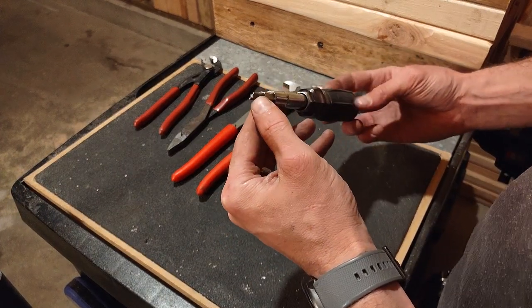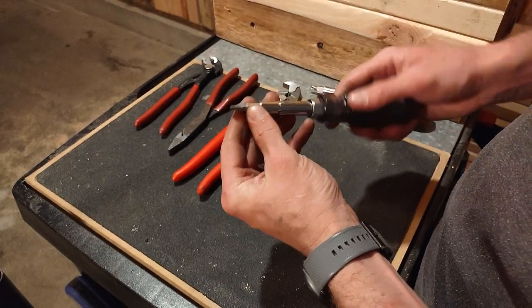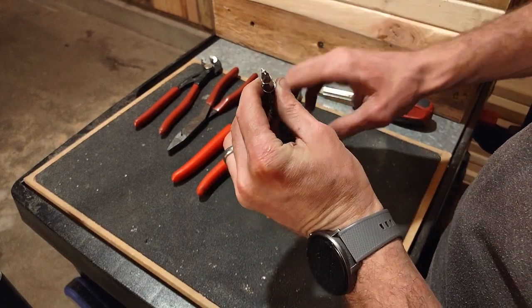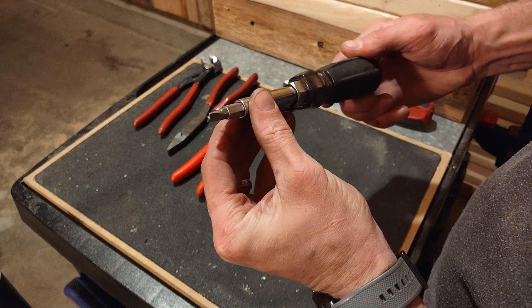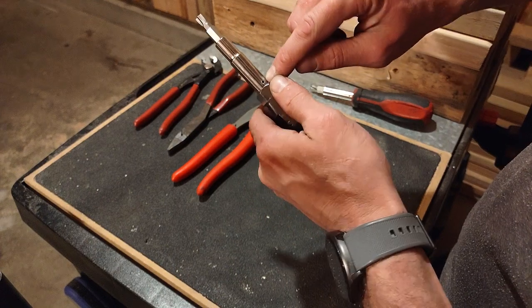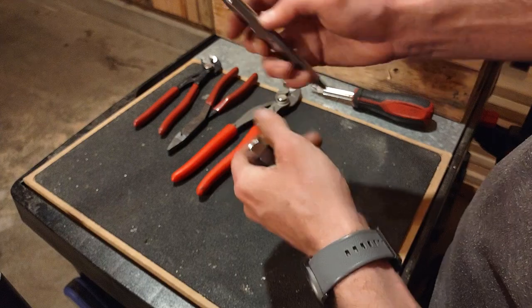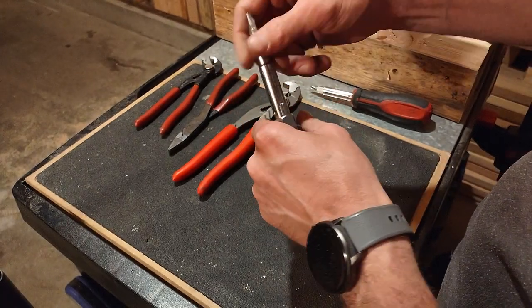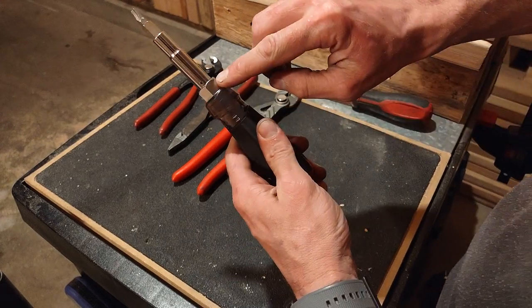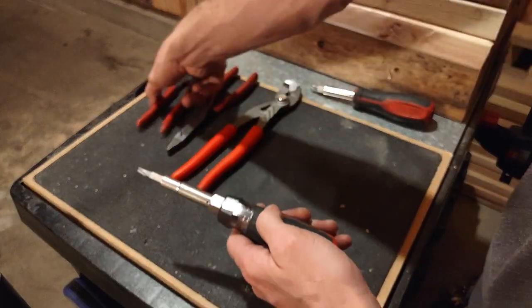So I'm swapping out outlets — I do a lot of residential maintenance. These ECX bits come in handy constantly, get a really good grip. It's got a mix between that Robertson square head and a flathead — kind of an interesting Phillips. If you can see that detail right there — this thing is sweet if you're doing outlets all the time. It's also got an adapter right here where you pop in your wire to curl it, so you can get good pigtails. It's a lot smoother and I really prefer the grip on it.